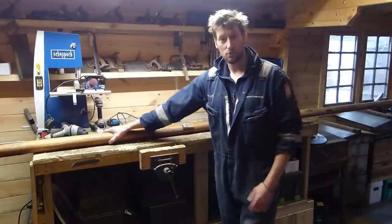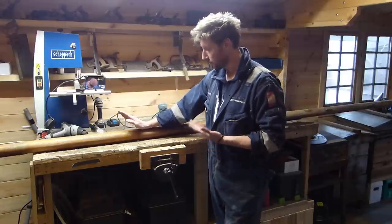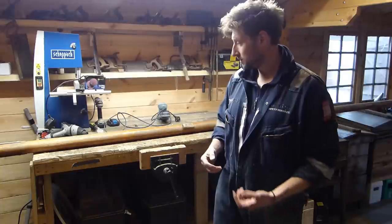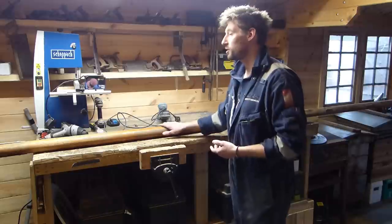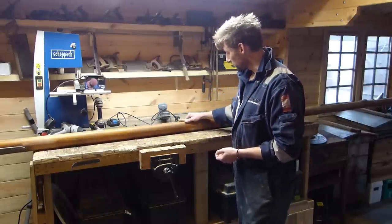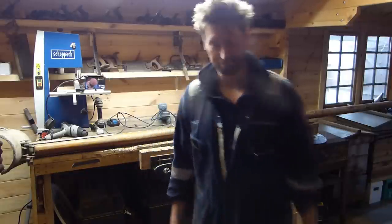The first thing we need to be doing, as with everything that we come to do in a restoration sense, is we get rid of all the dead material. So we're going to get all this varnish off, going to get that leather off there, make sure that that's not rusted and heavily corroded under there. I'm not seeing anything too nasty going on in this spar so far. It was quite well looked after. There's really only cosmetic issues on the surface that need dealt with. Let's get our masks on, let's get our scrapers out, and hop to it.